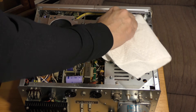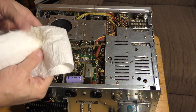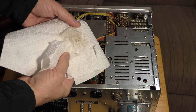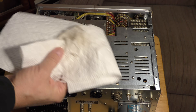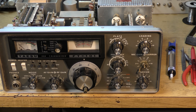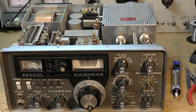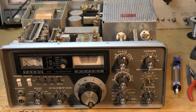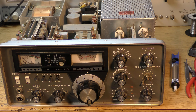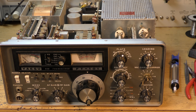I'm not seeing signs of surface corrosion. I went over it with some multi-purpose cleaner. The 101 is now on the bench. I want to try to get in there and clean things as best I can, which means the cards need to be removed, the final cage needs to be opened, and the tubes need to be removed, cleaned up, and tested.